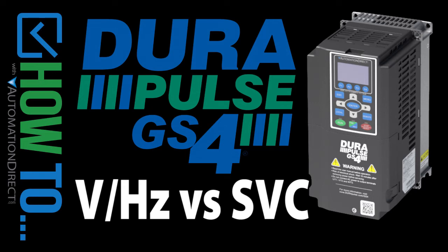What is the difference between a GS4 drive's Volts Hertz and Sensorless Vector motor control modes, and which one should you use? Let's look at Volts Hertz first. One of the cool things you can do with the GS4 drive is you can modify the Volts Hertz curve to suit your application's needs.